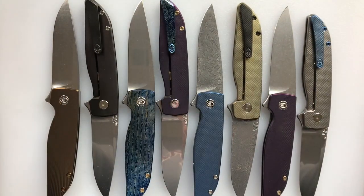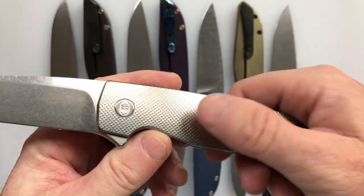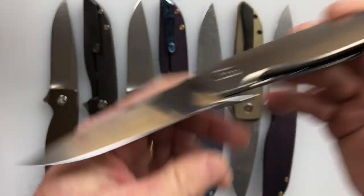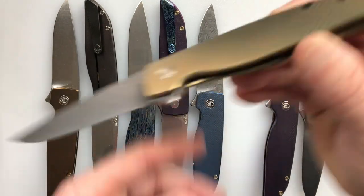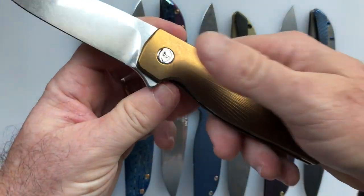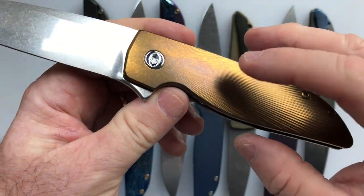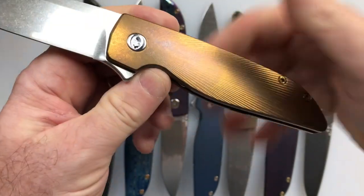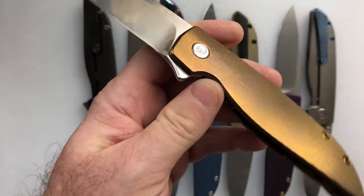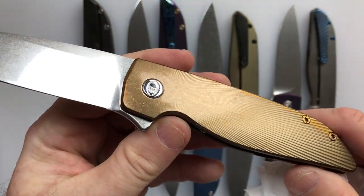And so I wanted to talk to you then about the stability of the anodizing and the combination of the anodizing and the process. There are some of the finishes and the colors, like for example the silver, the color is completely stable, and the gold, the color is completely stable also. Whenever you get into the bronze, the color changes a little bit. I'm going to fingerprint it up a little bit, and I don't know, it actually looks kind of cool. You see some blues and some purples, and it's no longer a uniform color, and I think that's kind of cool. And then if you want it to be a uniform color, you can get some Windex and you can wipe it, and ta-da, it's all uniform again and it looks beautiful.